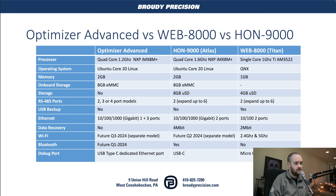As a comparison with the 8000, the 9000, and the Optimizer: compared to the 9000, we're looking at a slightly slower processor — I don't know that you would really notice a difference with that. Same operating system, same memory, same onboard storage. We don't have the ability to use an SD card on the Optimizer. We can do up to four RS-485 ports. No USB backup. Ethernet ports — we've got those three switched ports on here that we don't get on any of the normal JACEs. Wi-Fi and Bluetooth are coming later on. And the debug port on the Optimizer Advanced is not a USB-to-serial conversion; it's actually USB and it shows up as an ethernet port on your computer when you plug into that USB so that you can connect to the controller over ethernet.